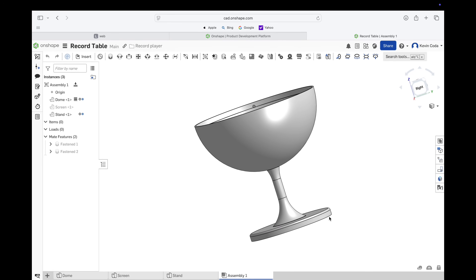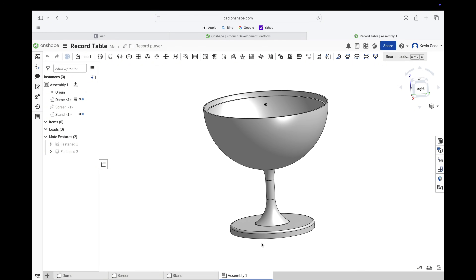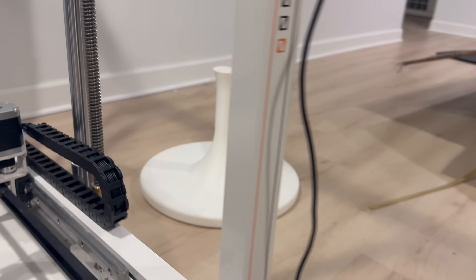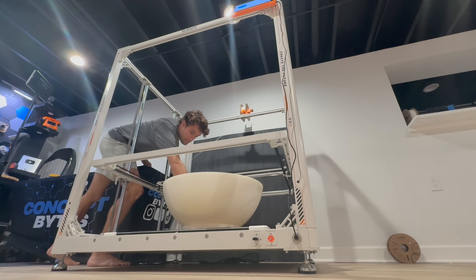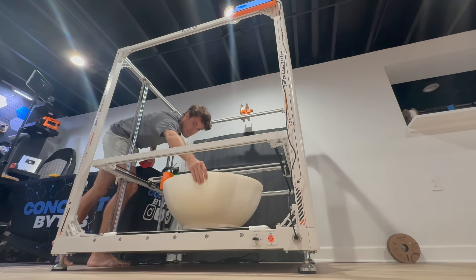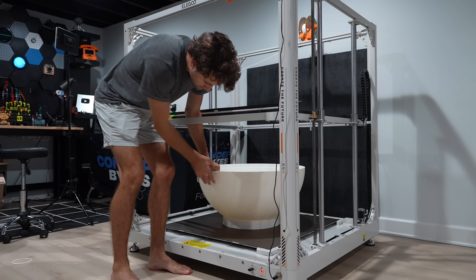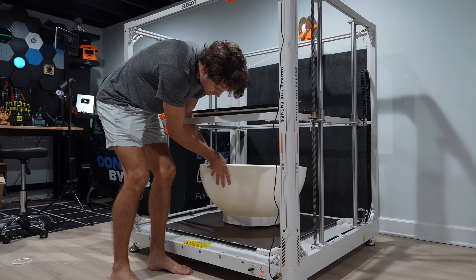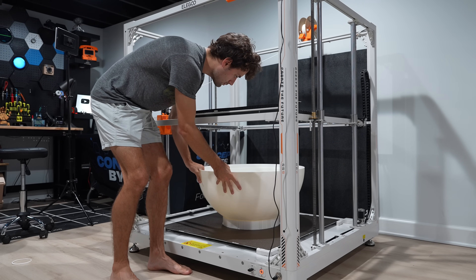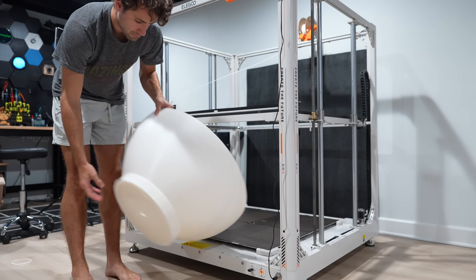Because I have no self-respect, I was going to print the bowl with the smallest portion on the build plate. Those four PEI plates really needed to hang on to keep the whole print in place. As it got bigger and bigger, I became more and more worried about it falling off and breaking. But the plates did their job. For the record, I don't recommend printing hemispheres like this — just flip them upside down. But everything came out okay. We just had to break off the supports to reveal our dome.